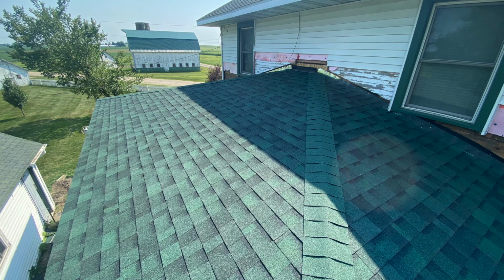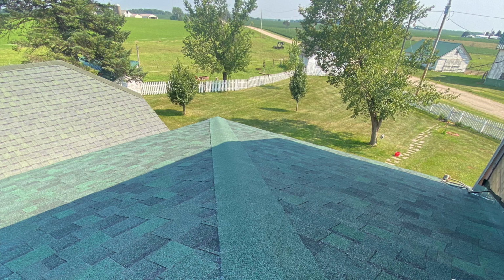Man, it feels good to have a roof on this place. It ended up being our 2 like 100-degree days that we get in southeastern Wisconsin when I roofed this. So filming got a little miserable, but here's a couple pictures to show you guys the finished product, or the almost finished product. Lines are nice and straight. Hip and ridge went on nice. I always make sure to snap lines for the hip and ridge shingles, because if you just guess, it always goes on a little rough.